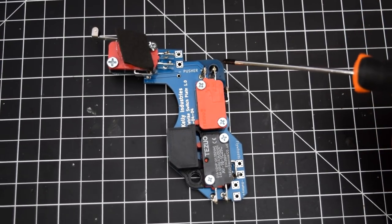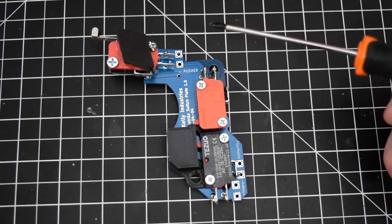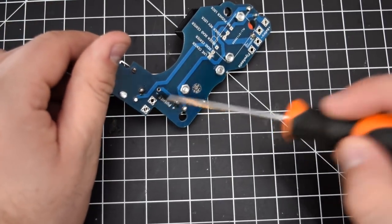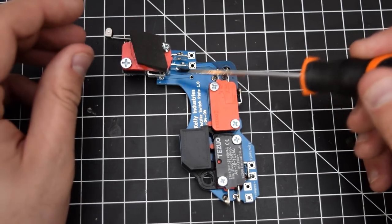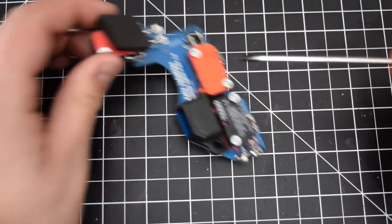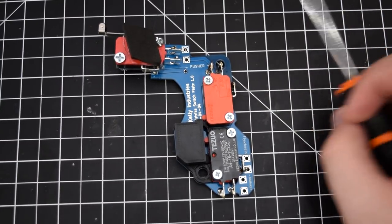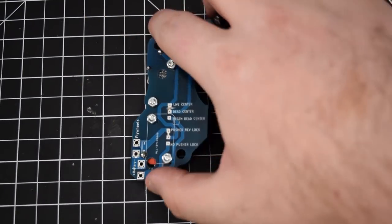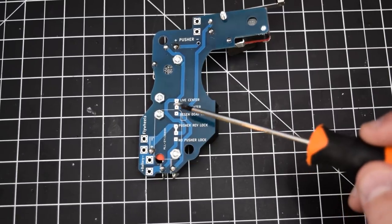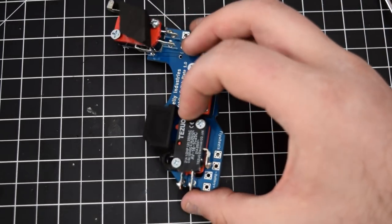You don't have to look at any diagrams to understand where wires go. Another pro is that the pads are solderable on both sides — not only the pads for the pusher, flywheels, and battery, but also the areas for the little wire pieces going to the switch tabs. I'd say to do it on the back, but you can do it on either side or both. Also, going to dead center is easy — you can always put a bridge back over it to return to live center.